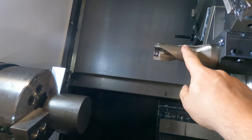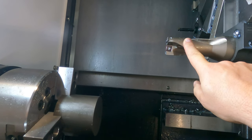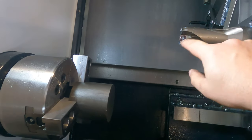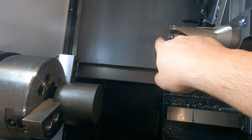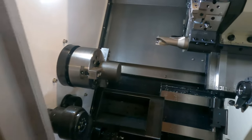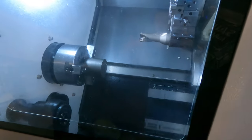What we do is, when we do the drill and boring, we're using this insert drill. Two different tool offsets. Basically, we do our regular drill and then we come in and do the boring operation with that one insert.